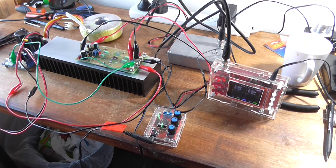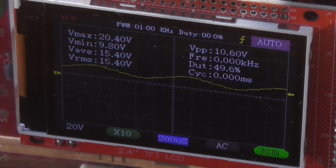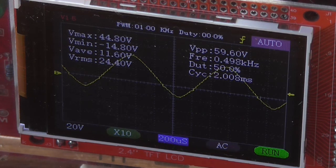So now we can go on to actually testing the power output. Everything is set up and turned on. I've got an output signal. Now let's have a look at our maximum output peak to peak. We are in x10, so we don't need to worry about calculating that value. Crank it up — there's clipping. Out of clipping, which is about there. I'm going to say it's very close to 60 volt peak to peak.